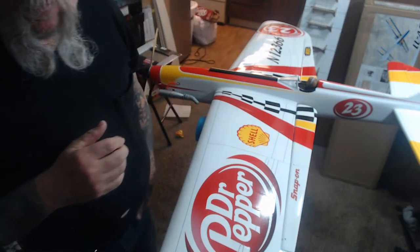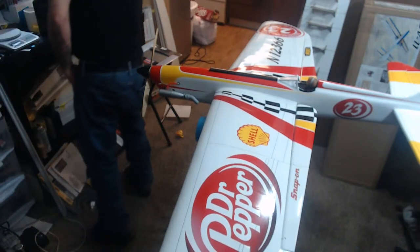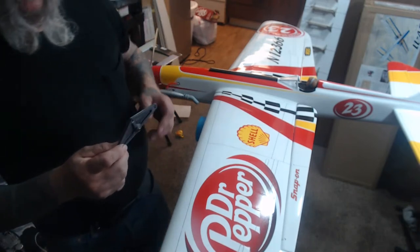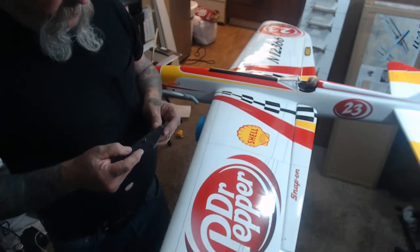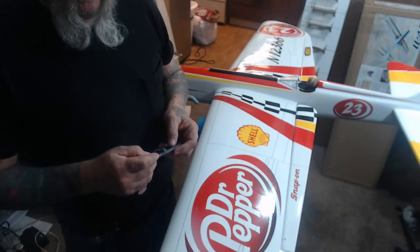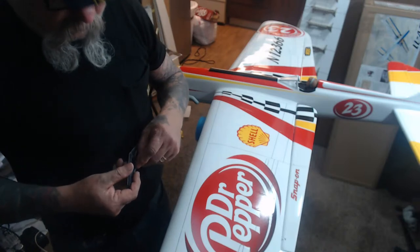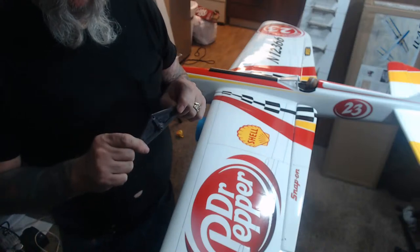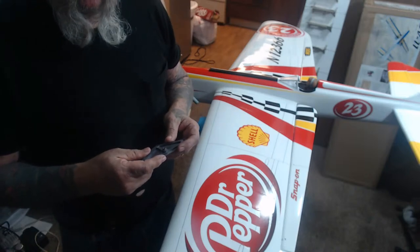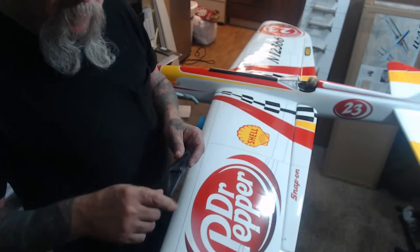All right, guys, been on an hour. Appreciate you watching. I hope you learned something about the bell cranks. We're going to be making these on camera come the 16th. Dan's going to give you all the materials that you need to make these. And we'll tell you, you got to make a plug. You got to make one of these first. You make it out of phenolic and then sand it smooth. And then he's got some special casting resin with aluminum in it. And you need some drill rod, and you poke 3 holes in it.